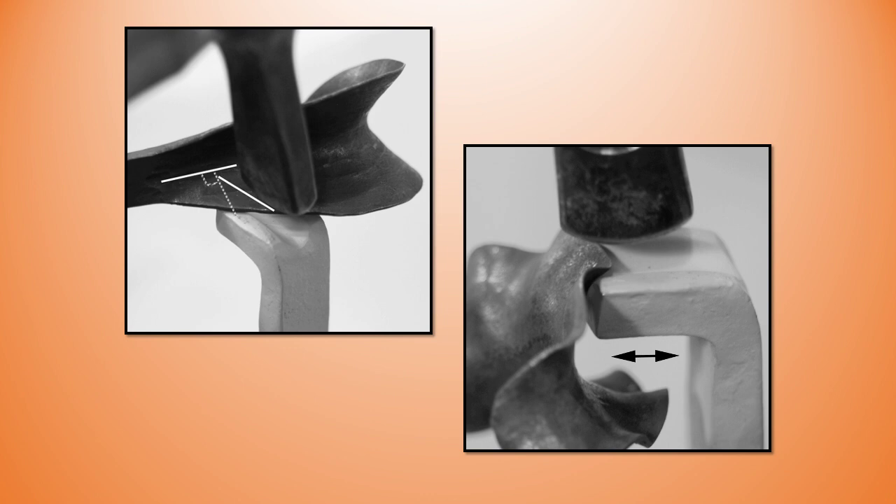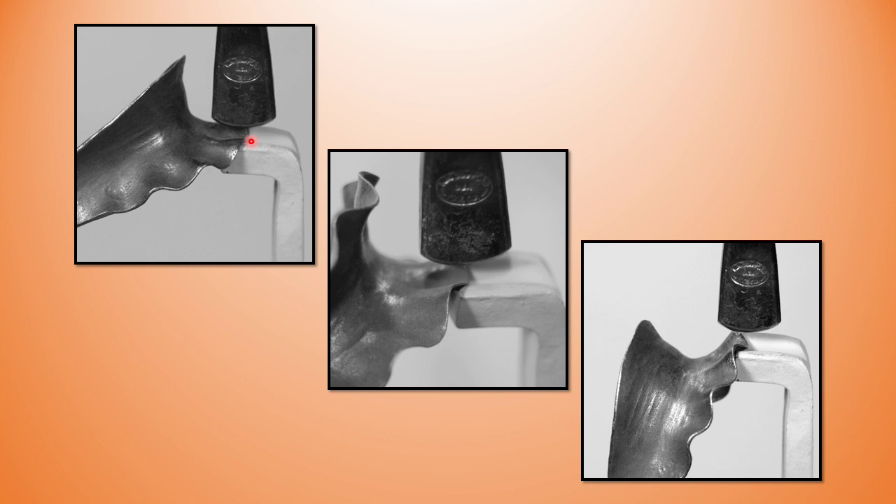The crimping stake needs to be able to accept the depth of the channel of the leaf, so you need clearance because you're going to be swinging this leaf to flare the edges. The crimping is not 90 degrees to the center line — it's off at an angle. If you were to divide the channel into thirds, the crimps are on the outer thirds with the inner third left uncrimped, and most of the flare goes right on the edge. I've got a slight crimp, the inner third is uncrimped, and as I'm tapping on that last quarter inch I'm dropping my tong hand to get a flare, working from the inside out and also from the outside going in.